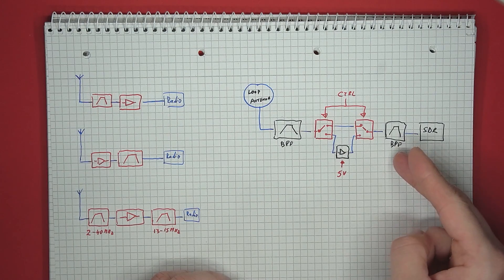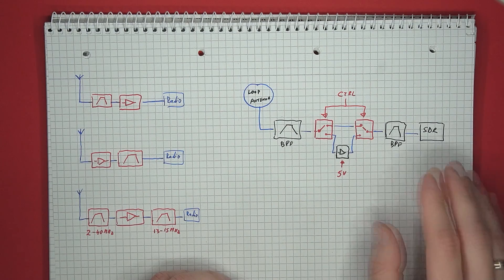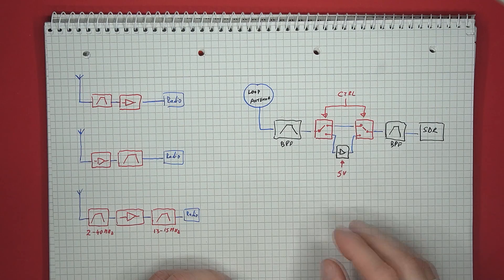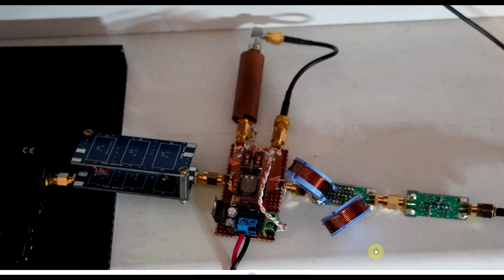The complete setup contains a DIY magnetic loop antenna, followed by an initial bandpass filter to isolate most of the HF bands, then the amplifier connected through relay switches for easy insertion or removal, and then a second bandpass filter isolating just the 20 meter band, finally connected to the SDR — a HackRF receiver — controlled from the computer. As a side note, even though the HackRF has a built-in BIAS-T, it only outputs 3.3V, so I'm supplying the amplifier from an external 5V supply. All blocks are built as standalone modules with SMA connectors, making it easy to add, remove, or reorder — it's a flimsy contraption, but a good first step before making a final design.